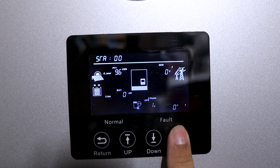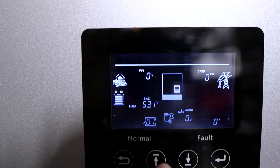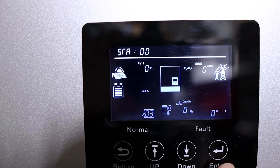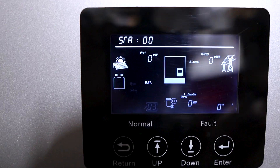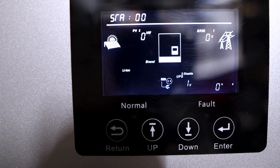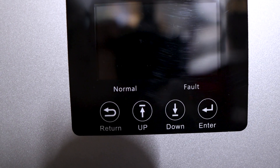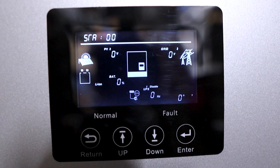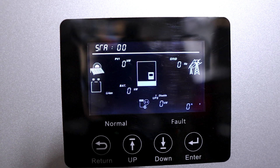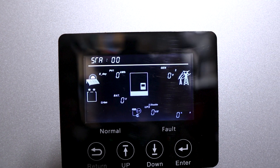First, come over to the Enter button, hold it down for about three seconds and let it go — your menu will pop up. Go to menu three, hit Enter, and you may have to select your battery type. I already have it on lithium, so I hit Enter again. The battery brand is going to be zero as well, so hit Enter again and it'll reset itself. After it comes on, I had to wait a minute or two before it actually started communicating — just leave it on and it should start working.